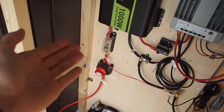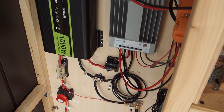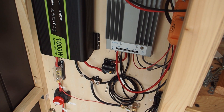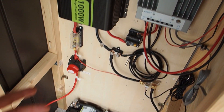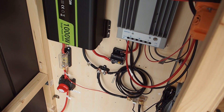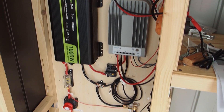If you size your fuses too small, they'll blow or the breaker will trip — and that tells you to use a bigger size. The real problem is sizing fuses and breakers too big, because then cables can start to burn. Make sure you size cables adequately to the loads, and size your fuses and breakers to match both the loads and the cables.